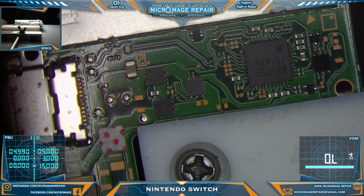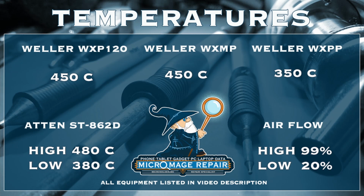While I'm setting up my equipment, let me throw up my temperatures. Disregard the lows on that because I was working on an orange screen of death and I did have to drop temperatures on that, and I just didn't get around to changing it. I don't expect to be using the lows on that, either airflow or temperature. I probably will use the Pico pencil to clean up after placing the chip. We usually end up having to do that because we squish solder out from below the chip.